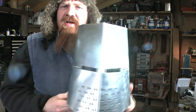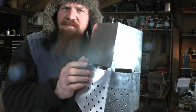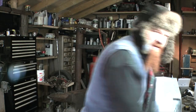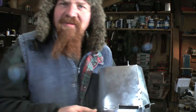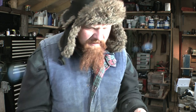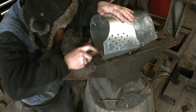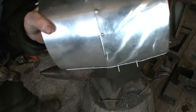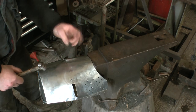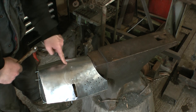The next job is to start the riveting. I've used bolts entirely so far to construct it, which is really good. If you do this, I really recommend bolting it first rather than committing to the rivet — especially if, like me, you've got no real idea what you're doing. Let's try what should be an easy one on the side first. The rivet is in — well, that doesn't look great. I need a rivet snap: a piece of round or square bar with a hole drilled in the end that will sit over that dome and finish it off. That just looks a bit mashed at the moment.